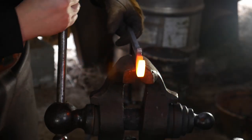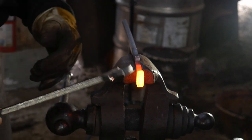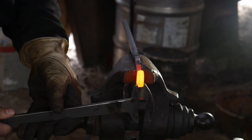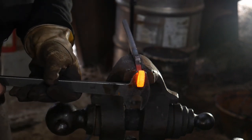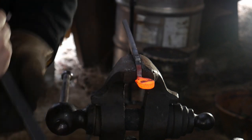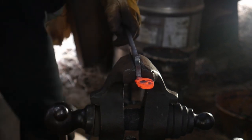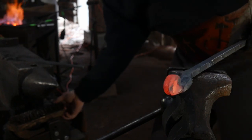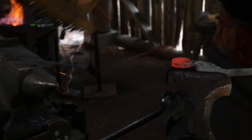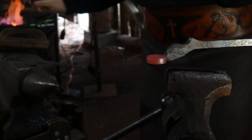Just like in the previous video, we're going to take and lock the boss in the vice, and then use the twisting wrench that they supplied. We're going to twist counterclockwise — to the left — on the first one, and get that nice and square and even. Very nice. Nice, square, even, and twisted to the left, just like you see it.